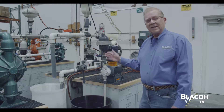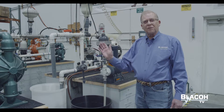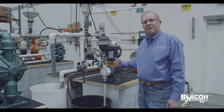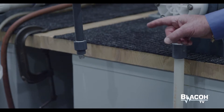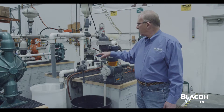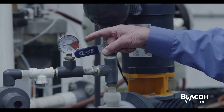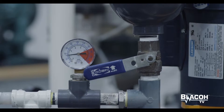It's a single diaphragm pump, so it discharges its fluid in the pump head then retracts to fill the head. That process creates a stop-flow type of action and also creates a big pressure swing. In this case we're going from about 35 to almost 200 psi as the pump strokes and retracts.